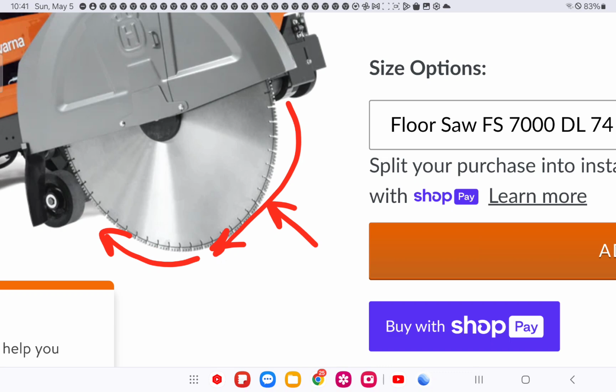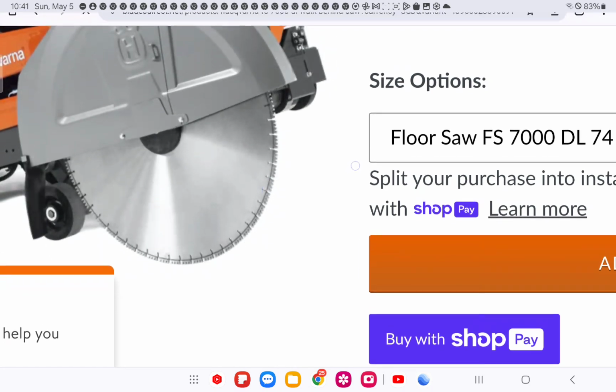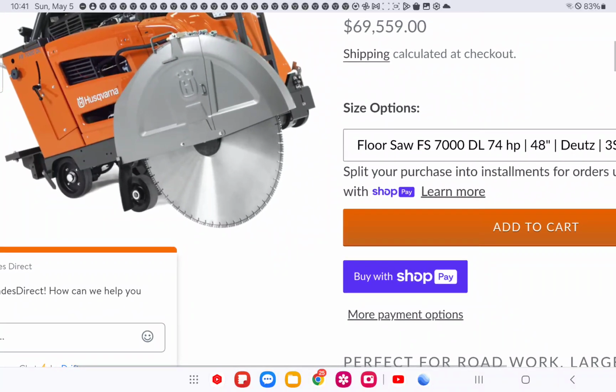So this thing came flying across. So what happened? You needed a few things to happen. First off, you need this shield. Let me do this. There's that hinge I told you about, right about there. There's the hinge. You got to undo these two because this locks this shield down. You close the hinge and do that. This one looks like it might even have another pin that would come across. Maybe not, but this would be the other thing to keep the shield down, because the shield would vibrate. If you don't lock this down, the shield bounces. It bounces along. The vibration in the machine makes the shield bounce, and it's a pain in the ass. So you secure it as it's ready to be operated.